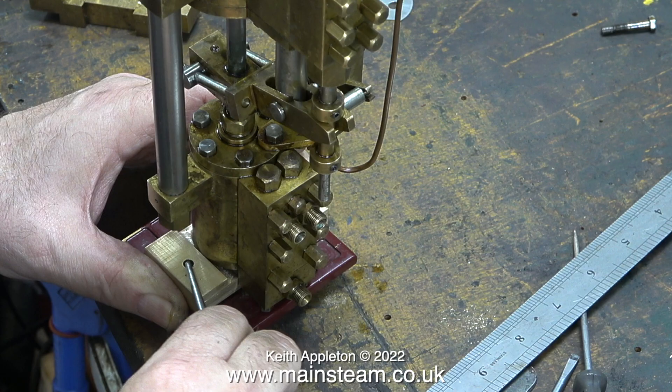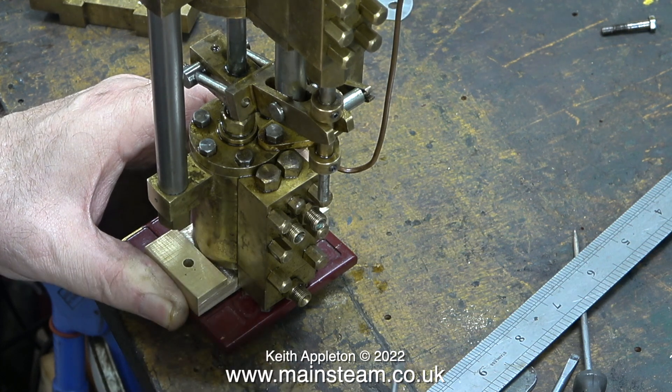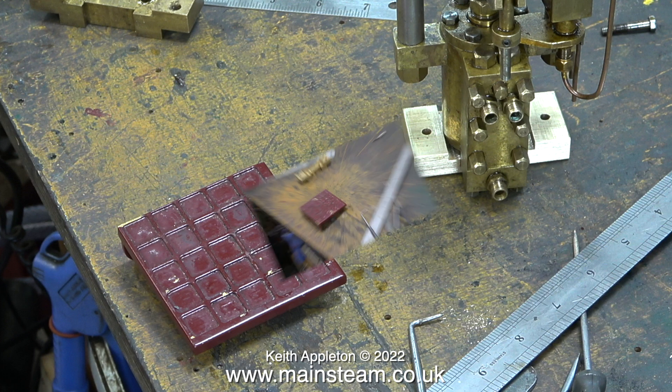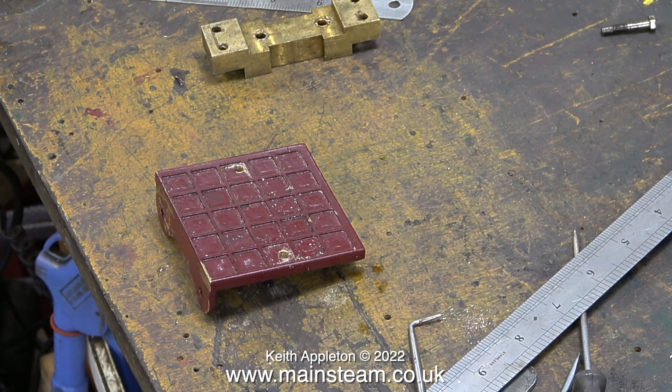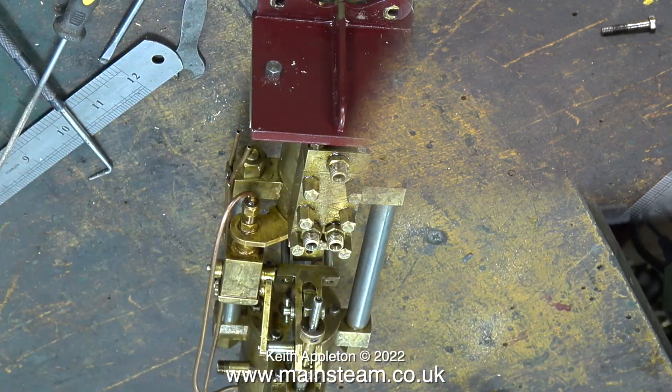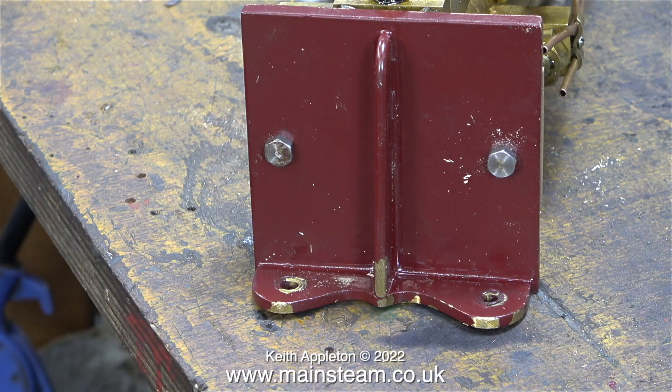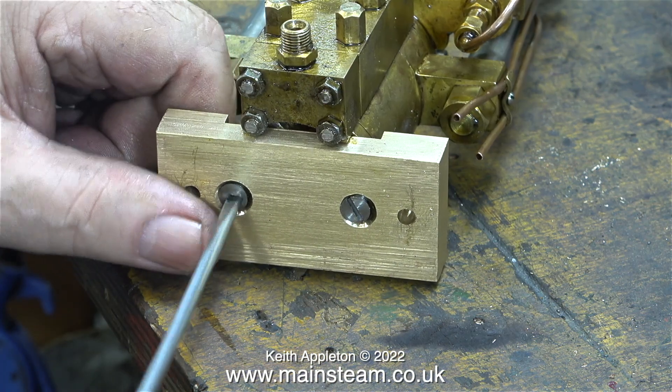This system is no good on its own though, because the two bolts can tilt the pump on its base. Using the right-angle point of my scriber and marking through the base onto the footstep to drill a couple of holes. The good news is my calculations are quite good because both of the drilled holes do not get in the way of the ribbing on the footstep. This means that if ever I wanted to remove this pump I could unbolt it, then simply fill the holes and paint them. Here's a shot from underneath - both bolts are in the correct position relative to the outer edges of the footstep.